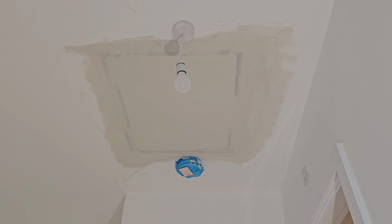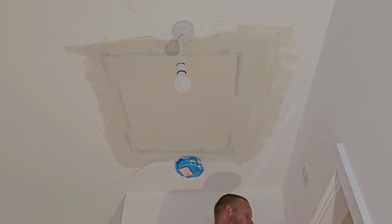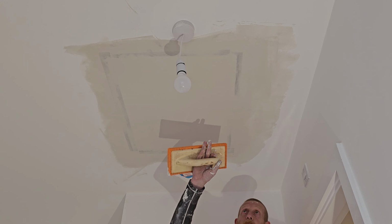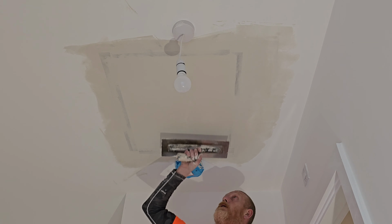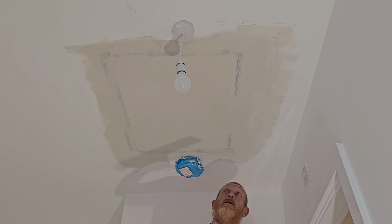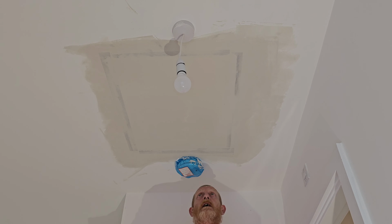Just bear with me. Right, sponge float. Now somebody asked me the other day on the channel, sometimes when they're applying these coats, they get a ripple effect. So let me just put the sponge down. What I mean by ripple effect is when your trowel's skipping over it. So sometimes when you're putting it on fairly heavy, like that's not that heavy, it's only a couple of millimeters. Sometimes, I mean, I can build this out up to 10-15 millimeters. So there's a trick for you.